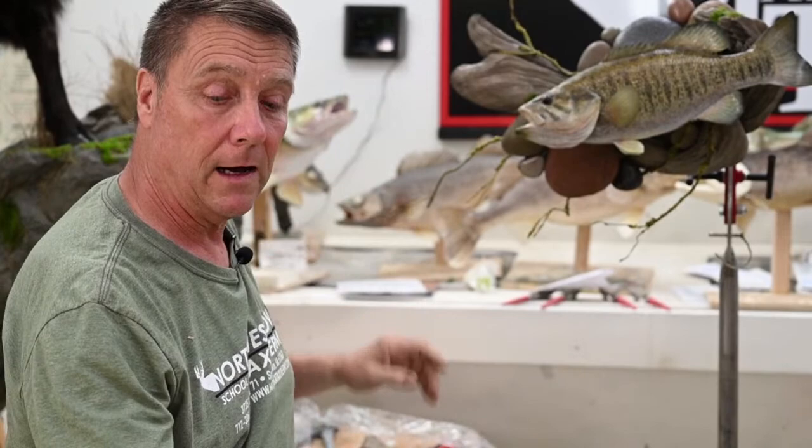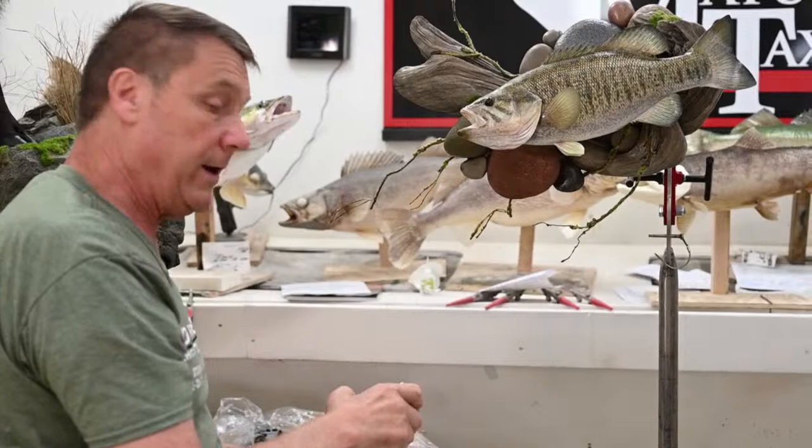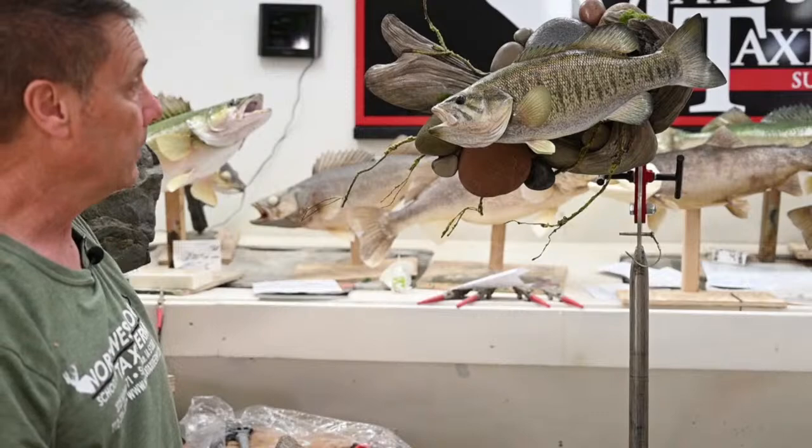I wanted them just a little bit on the glossy side. I just took the gloss aerosol. Okay, here's what I did. I got it way too glossy. I looked around, grabbed a terry cloth towel, and I just touched it to it and marred the finish, and it gave me a low luster. Just don't leave terry cloth threads all over the place. Make sure there's nothing caught in your towel.